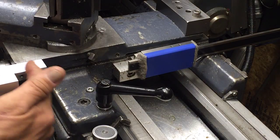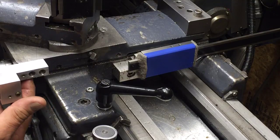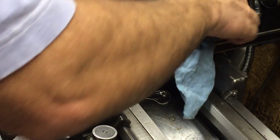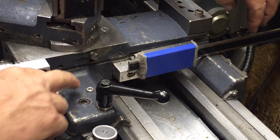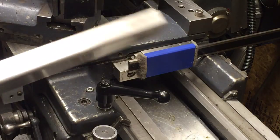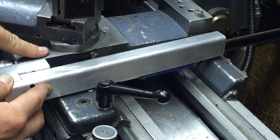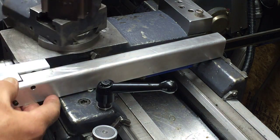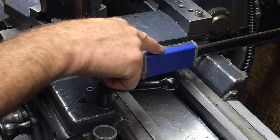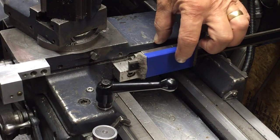The other one is right underneath here — this cover does not cover that screw for the grub screw, that's right underneath. So I just left a gap there. If you want to get the scale closer down so it clears the saddle — for this system I got it as low as I could, so it had to be low enough that it's just a few thousandths below this surface here. You can swing this around — you can see it rubs a little bit but not too bad. I lost about two inches of room here, because the guard goes over that.